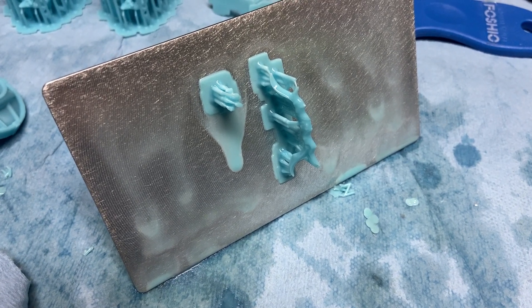Back to the machine - the LD-002R has really nice print quality down to about five-second layers. It comes with a rough surface build plate, unlike the Elegoo which has a smooth one. This one has a kind of machined texture to it with a little roughness. I found the bottom layer adhesion really strong - I'm using maybe 60 seconds on the bottom layer - and I had to scrape hard with the plastic razor blade to get prints off, so the adhesion is really good.